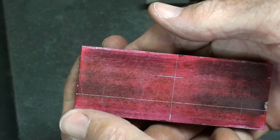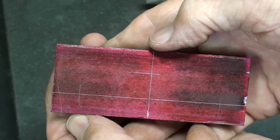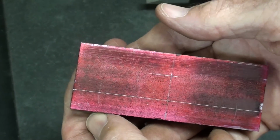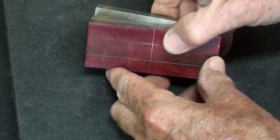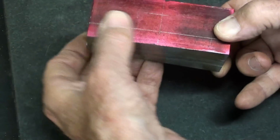There is no digital readout or accurate scales. The machine is pretty worn out, so I'm going to go by layout. You certainly could or should do this with a DRO if you have one. You absolutely positively have to drill and ream all in one setup.